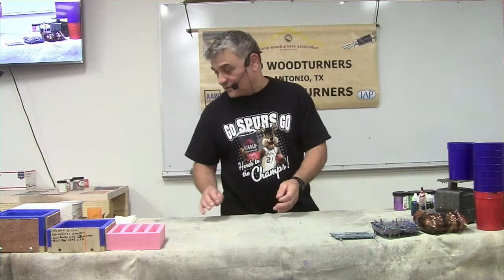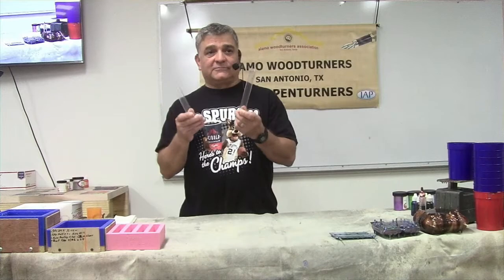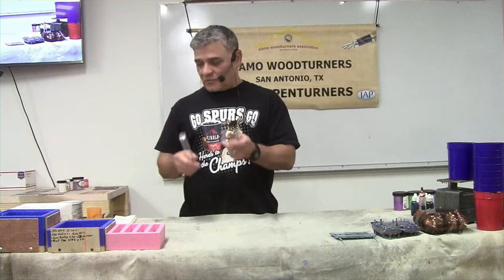For equipment - you can use anything for a mold. These are plastic tubes from Hobby Lobby where they put candies or seeds. Normally it'll be a one-time use because it'll stick or deform from the heat. You can also use your wife's baking dishes - just put some release on them and they'll last forever. Just don't put them in the dishwasher.